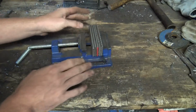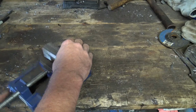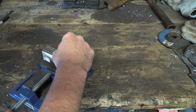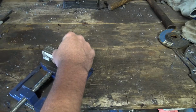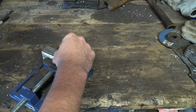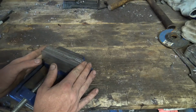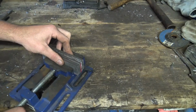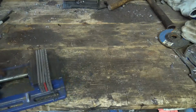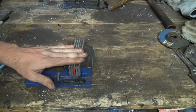Okay, this is going to make for a decent sized billet. If you were doing this by hand, this wouldn't make too big of a billet. It'd probably be enough to make a knife or two, because you're going to lose considerably more mass to forge scale doing it by hand than you would with a power hammer or a press, because you have way less heat. You get more work done faster, so less time for it to scale off and oxidize away.